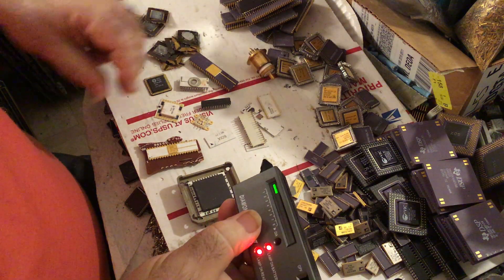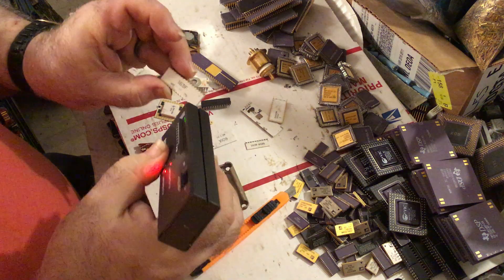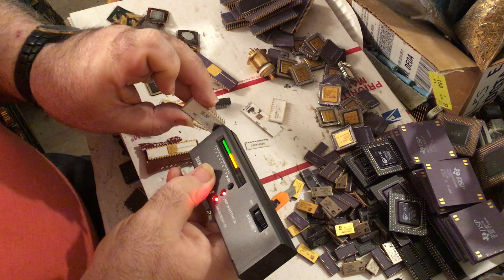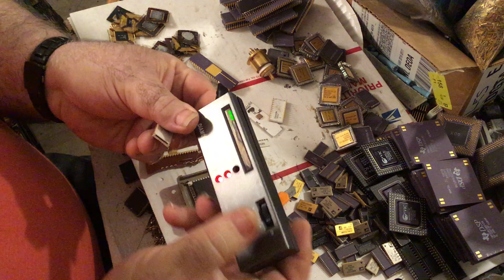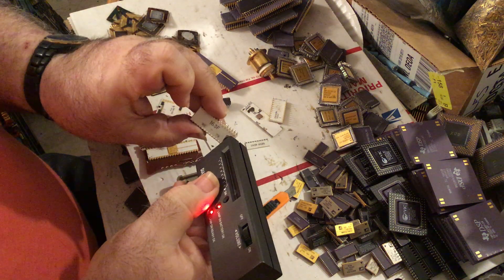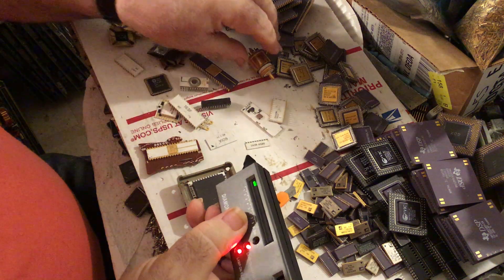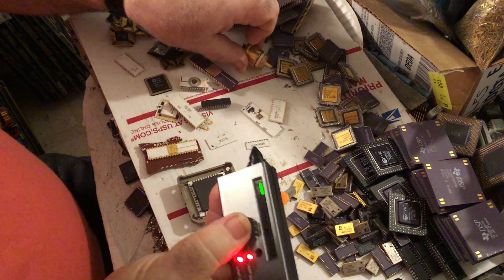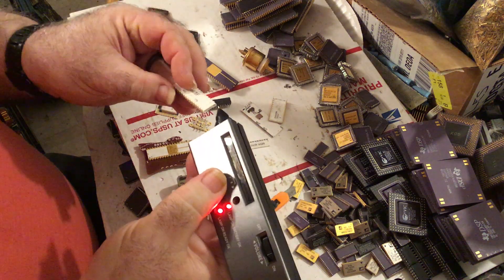So that's kind of my known standard. If I test against some just normal chips — this is a Western Electric chip — it's reading fairly high, but it's kind of right on the edge. Like I said, this thing creeps over time, so I'm going to turn it down to where it shows nothing. Now I've got a lower reading. Let me see if I still get the beryllium oxide — yep, that still gives me full scale. You have to watch that while you're using it, because it does kind of creep.